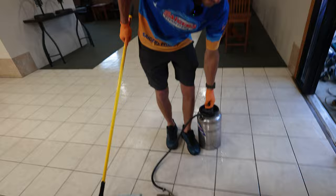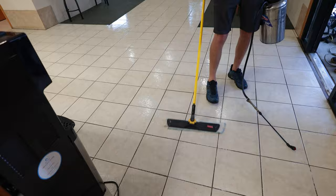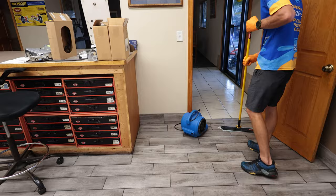It will not clean anything. No, it's not a cleaner. So if you leave something behind, like I was saying, like your own chemistry or you didn't rinse enough, you'll see white haze. It's not from the sealer. That's going to be invisible. So he's working his way out. Shut off the lights. We're going to just keep that fan going there for a little bit. Again, if there's a footprint, you just reactivate with it, it'll take it out.